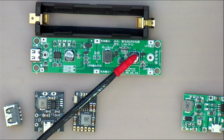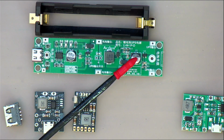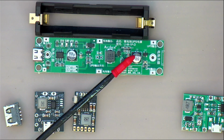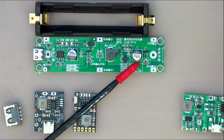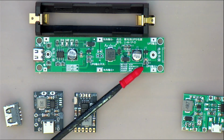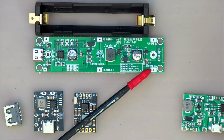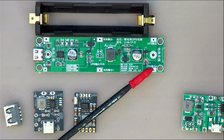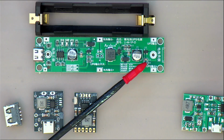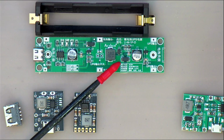And again, from what I've seen so far, this is an ordinary cheap electrolytic, I think, capacitor, and the ripple voltage is higher than I'd like to see it. So no doubt if you're going to use this thing, you also have to hook up a better low ESR capacitor or some sort of filter circuit on it, maybe even including a little inductor or something. But other than that, it seems to work okay. We will have a look at that, of course.